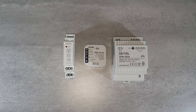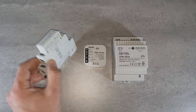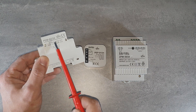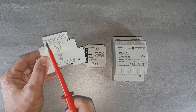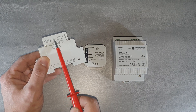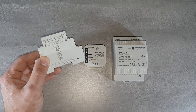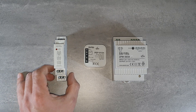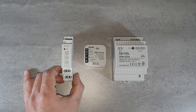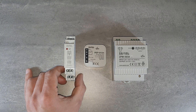The relay has a load capacity of 8 amperes each, a single 24 volt coil, and two galvanically separated outputs operating in parallel — for example, switched on and off simultaneously. The outputs, similar to those of the PEP-01, are NO-NC switchable relays. The device occupies one module. A full description of the parameters is located on the side panel.